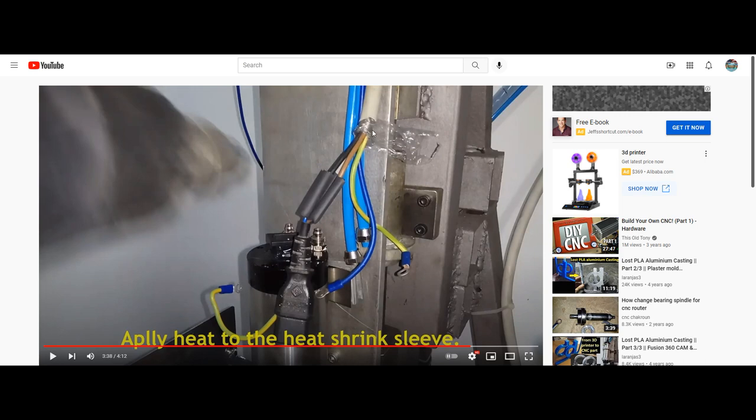This is treacherous and should be corrected immediately. This is not best practice. If you do not know how to properly remove the tin braided copper shield and terminate it, which in this case, it looks like it's terminated somewhere in there, he should have removed the excess and insulated this.